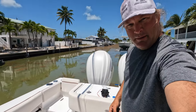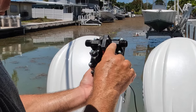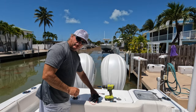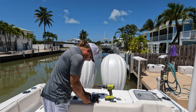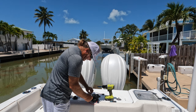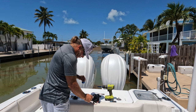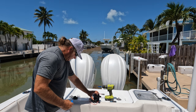Pumps out of the boat — we're going to get the new pump ready. On your new pump, the bottom shows the water flow with an arrow: this is the intake, that's the outtake. The screen goes on the intake. A little shot of Teflon tape here — when you put in your Teflon tape, think righty-tighty, so spin it the same direction you're going to spin it onto the valve. It doesn't need much, just one quick wrap. Make sure you don't have any Teflon going into the inside of the pump.